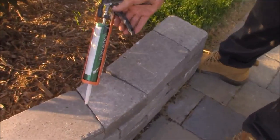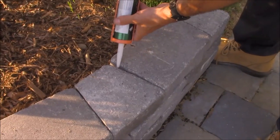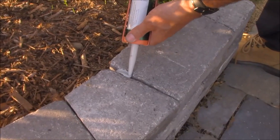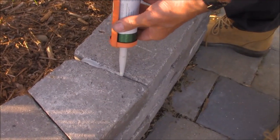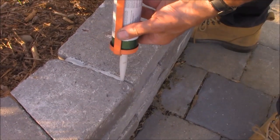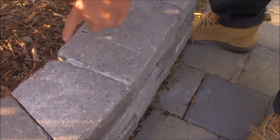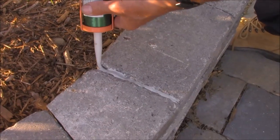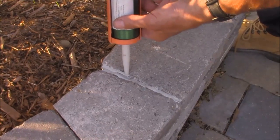We're going to start with the gun-grade. Here we have some cracks — some hairlines and some thicker ones. I'm going to show you on the thicker crack what this looks like when it comes out. You can see this product is going to stay where I put it; it's not going to level. Where it's thick, this is going to have to be done in two steps, so we get a little bit on each side and let it adhere. If we have to put a little bit more in there, we will.